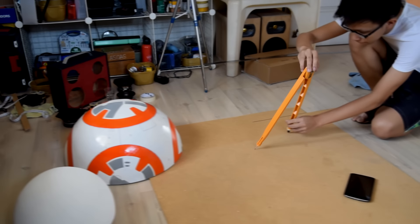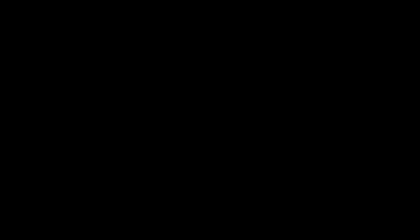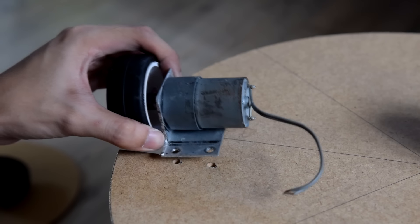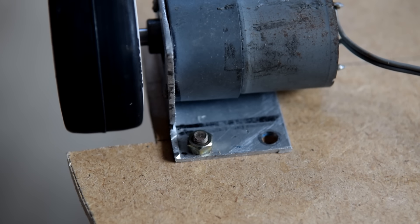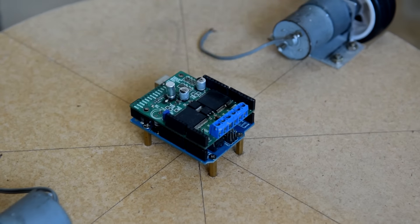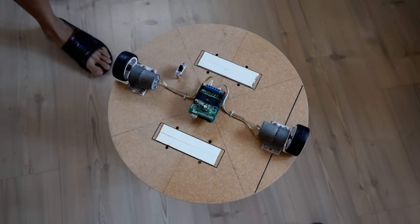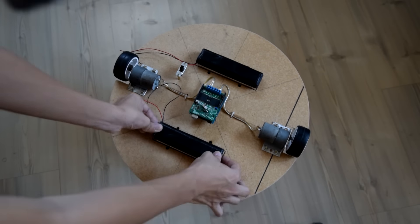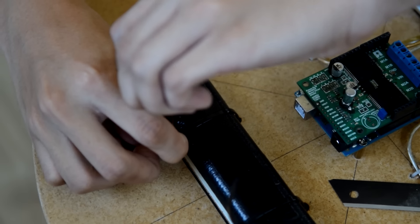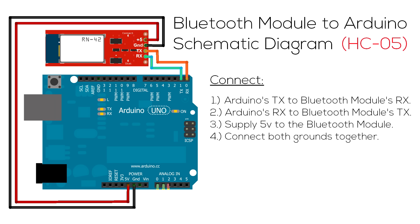If you're wondering, that is a really large compass. For cutting the pieces of wood, I used my jigsaw — it's much easier and less tedious compared to a hacksaw. Now I drilled some holes for the brackets and mounted the metal gearbox. Then I suspended and mounted the Arduino in place over three studs of metal standoffs, then stacked the motor driver over the Arduino, and connected the left and right motors to the motor driver's terminals. I mounted both packs of lithium batteries with strong strips of mounting tape, and to make it even more secure I added zip ties, reducing the chances of the batteries falling off the mechanism. Now connect the Bluetooth module to the Arduino — just follow the diagram.